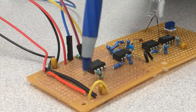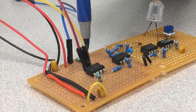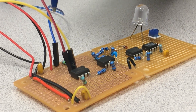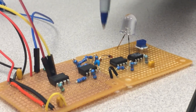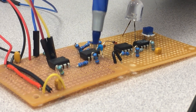The red wires connect the power to both sides of the soldering board. Here we have a differential amplifier that amplifies differences between the two muscle sensors. After that it goes into an inverting amplifier with a gain of around negative 15.